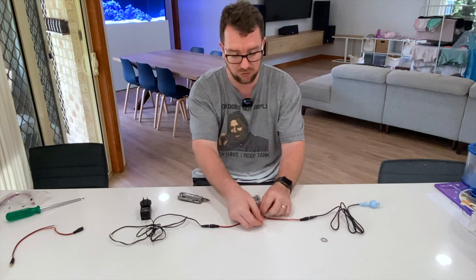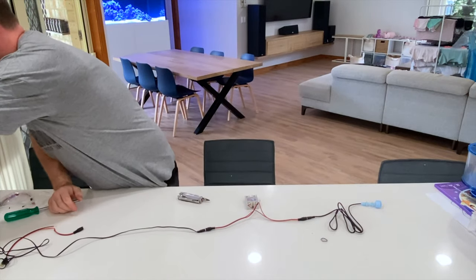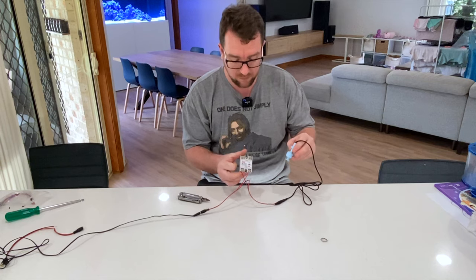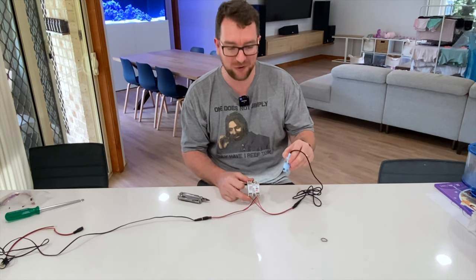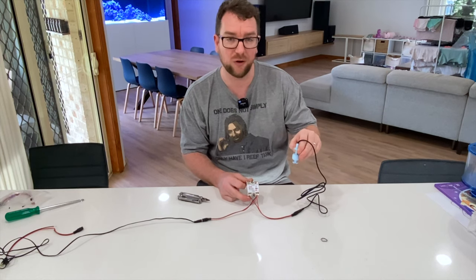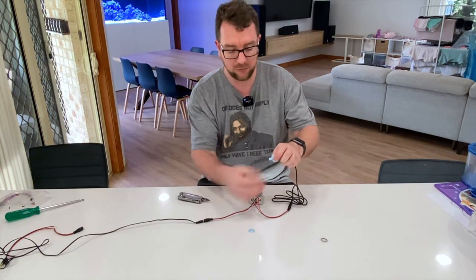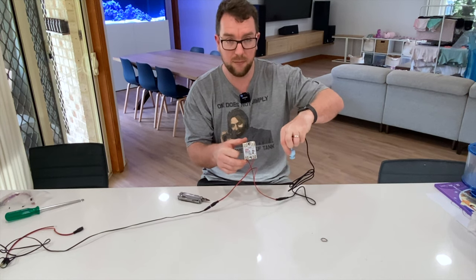We would solder and heat shrink that connection, but for the moment we can test this. I'm going to plug in the power — you'll see the advantage with these relays is there's a little status light that tells you when it's functional. At the moment it's not, and our float switch is down. But when I lift the float switch up you can see the light — that means the two contacts are joined. As you may notice this is actually backwards and it's not going to work for us: when the float switch is down power is off, when it's up power is on — meaning when it's overflowing it'll turn the skimmer on. But we haven't stuffed anything up. These little float switches work on a little reed switch and a little magnet. All you do is pop off the end, take the magnet off, turn it around, and pop it back on. Now when the float switch is down power is on, and when it's up power is off. Easy as that.